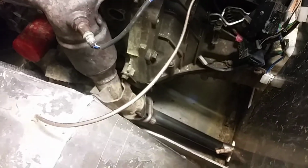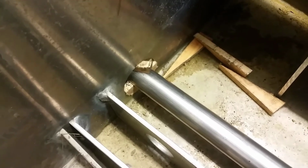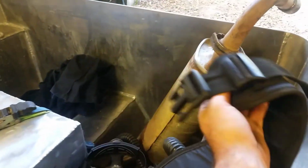I'm just working on the exhaust because the exhaust was obviously again just a temporary cobble up. So yeah, I'm trying to make a half decent exhaust up. Some little half wooden half washers there to try and centralise it, and then some wedges. Run that down several joins, and try and get a proper exhaust on there before I put floorboarding and stuff down. That's going to come out. I'm going to join it up to an original Suzuki back box. That's the plan anyway.